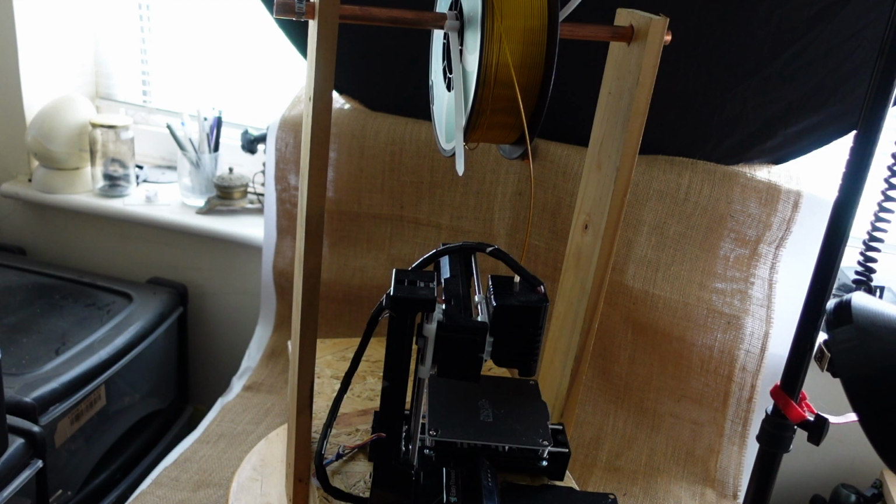And it provides a better underside surface for the prints, because what tends to happen with this one, because it's like a kind of perforated sheet, the actual bottom part of the print sinks into the bed, so that anything on the bottom of the print won't be reproduced at all, whereas on the standard Ender 3 print surface, the bottom surface is reproduced faithfully.